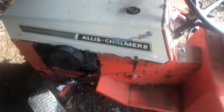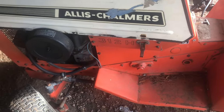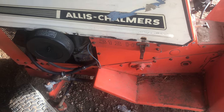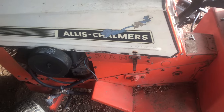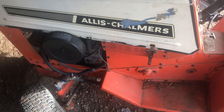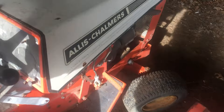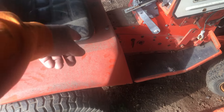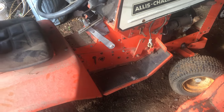That's what it looks like with the hood down. I got the mower deck with it, and then I already had another Allis Chalmers specific mower deck. The Simplicity attachments don't fit on here unless you modify them, and the mower decks are totally different — they're stamped. The mower decks on the Allis 300 and 400 drive off the front of the motor, whereas on the Simplicity they drive off the bevel gearbox on the left side. So I believe the discharges are opposite.